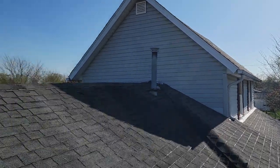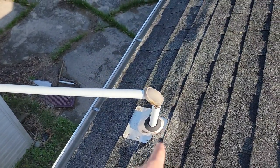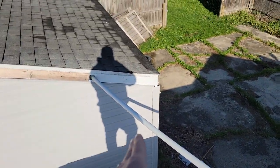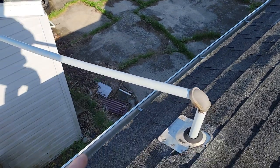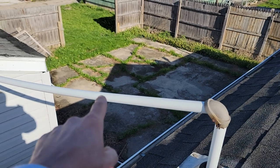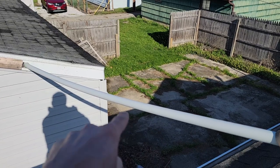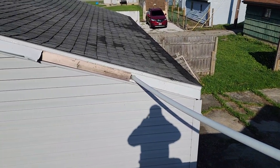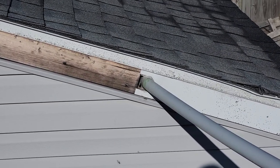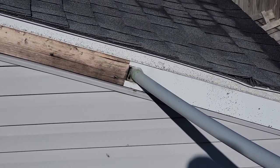It's just way smoother. This — not so good. I don't know that it's a really good idea with a sloping pipe sloping down into your fascia board like that. Reason being: water, when it rains, hits this pipe everywhere, and it's just going to slope downhill right into there — probably not too good. Over time, water gets in there and starts rotting that out. You can see the board's starting to rot just a little bit. Caulking's obviously failed. Also, an area for little birds to get into, bees and things — not good.